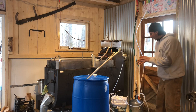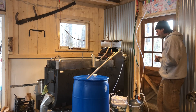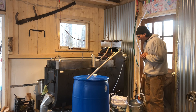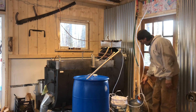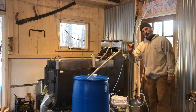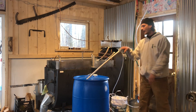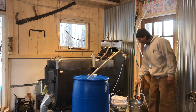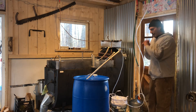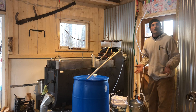You just leave it and let it run for a little bit, then go back and check it. As far as maintenance, every night when you're done, you want to take five gallons of the permeated water and run it through the system. Open up the needle valve completely, run it after you've already pulled out your supply and run it dry. Put the supply back into a full five-gallon bucket of permeated water, open up the needle valve, run it completely through that system, run that dry, and that's how you put it away for the night.